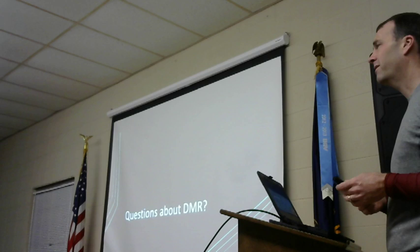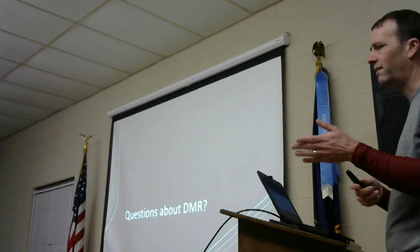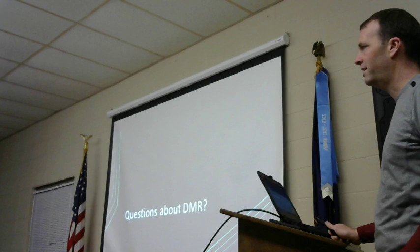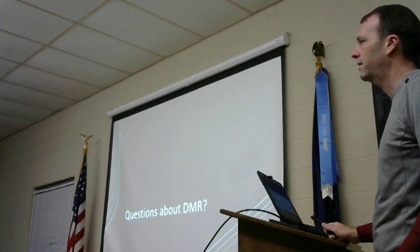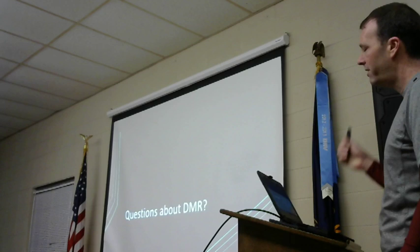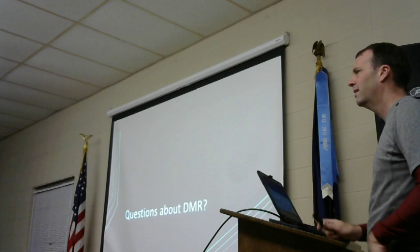For example, we use Southwest Missouri and Southwest Missouri Skywarn on time slot one. We figure if one's active, the other one's probably not going to be. Those are our most important. The ones where we have BURG, that's our choice. No one made us do it. It's just a lot of people like that talk group, so we keep it by itself. Mainly we put it on time slot two because they put it on time slot two and it just makes it simpler for everybody. They know BURG is time slot two. So you can put that on your radio and it's not as confusing. You don't have to think, oh, I'm in Joplin, now I need to be on BURG on time slot one, and oh, I'm moving to the Mount Vernon repeater, I have to be on time slot two. It's just more to keep it simple, keep it organized.